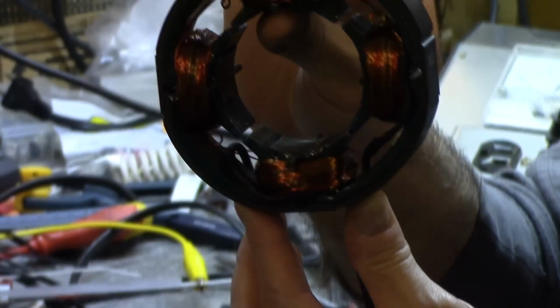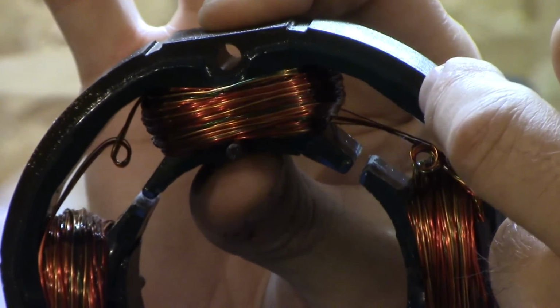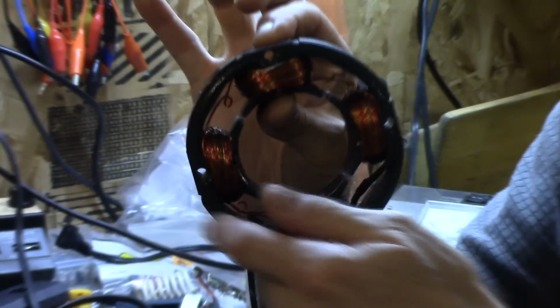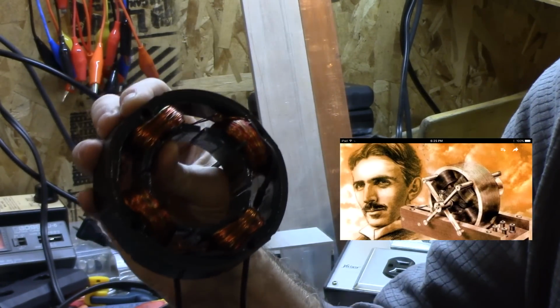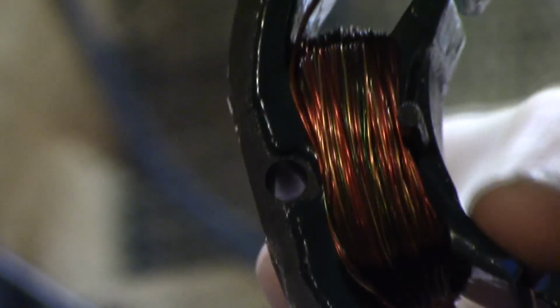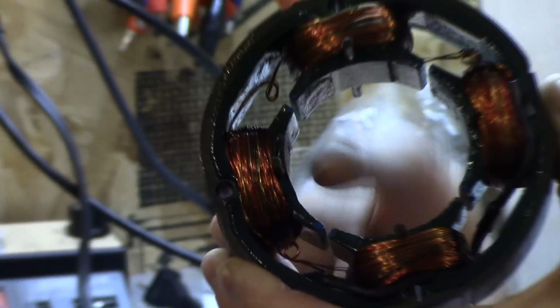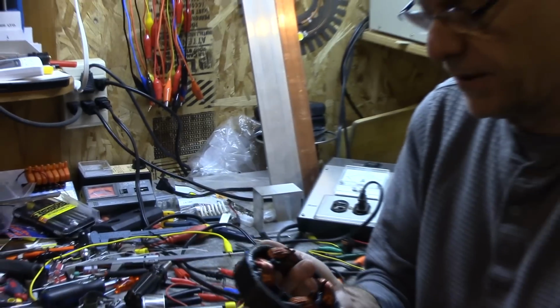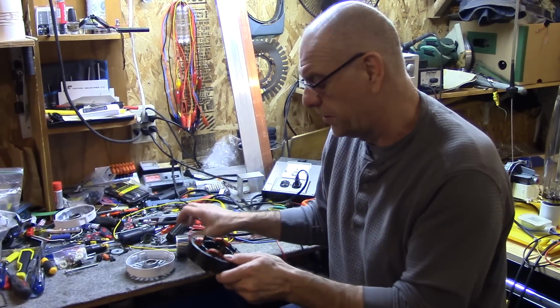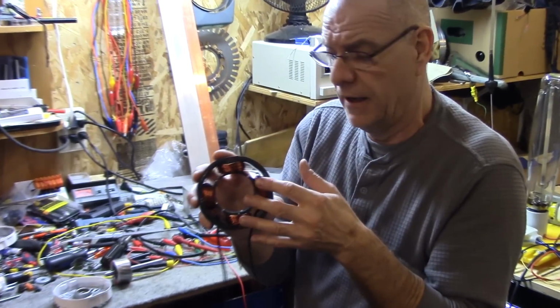It has an anti-cogging system stator, and if you look at that stator and you know about Tesla, that is the first design he did when he made a 4-pole alternating current electric motor. This is the exact design of Tesla, and the only difference is the ends of the legs have a long lip on it. They put that there to get a release and a grab, a release and a grab, which is what I found very interesting, because now I can reduce my anti-cogging. For the first place, the wire is wound left, right, and left again.